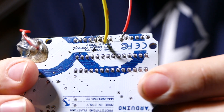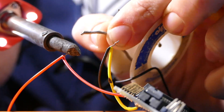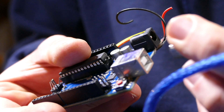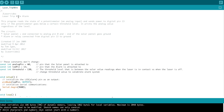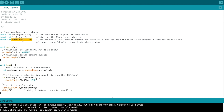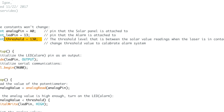The solar panel's positive wire goes to the analog zero pin and the ground to ground. Here's what we want the code to do: when the laser beam is shining on the device, nothing happens, but as soon as the beam is broken, the alarm goes off and keeps going until someone turns it off. We take the input voltage from the solar panel, read it through the serial monitor, and whenever it dips below a certain voltage — meaning the laser stopped shining on it — it sends a signal to the alarm. I'll leave the code in the description for you to download and put on your Arduino.